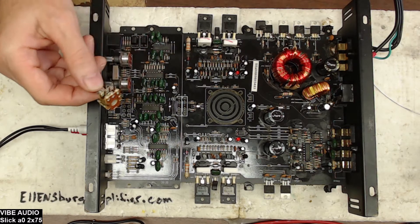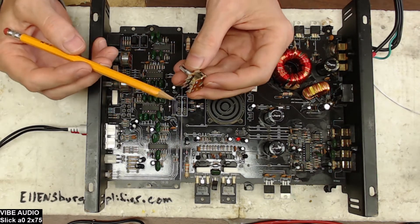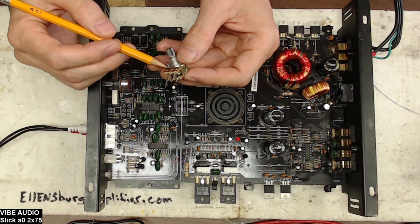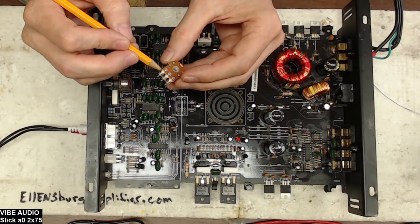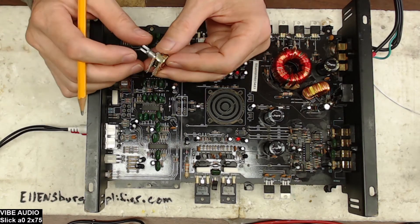Sorry Tyrone, I had to wait for this to show up. The gain potentiometer was bad and I had to order in a new B20K for the gain potentiometer. The original one had an open potentiometer and the other one was still functional, but I could not get the potentiometer to work right because of the way these legs are pressed into the carbon trace — in my opinion it's just a bad connection design.